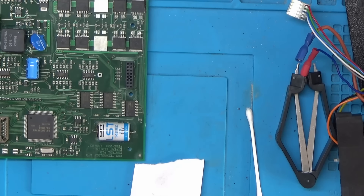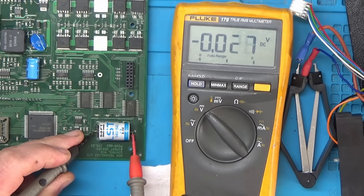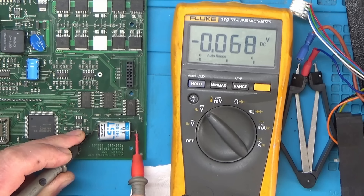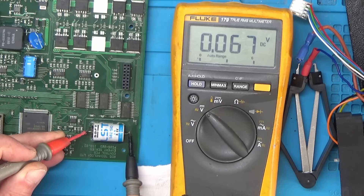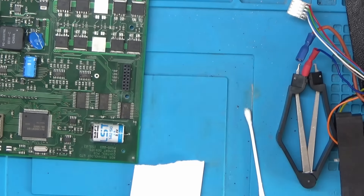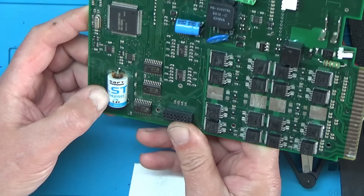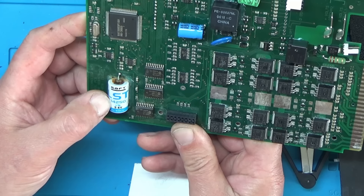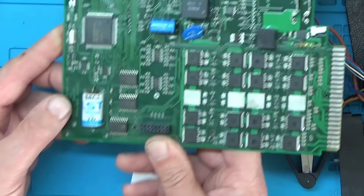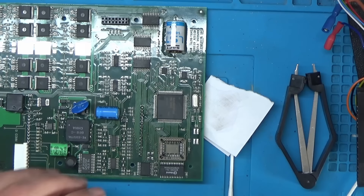Let's see if we've got any voltage in this battery. Yeah, that battery's just dead — this needs a new battery. I'm going to look for a replacement. It's a Saft LST 14250, 3.6 volt. I've ordered a new battery — I think it was £5.79 or so. Let's get the EEPROM put back in.